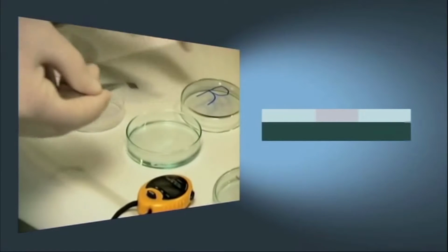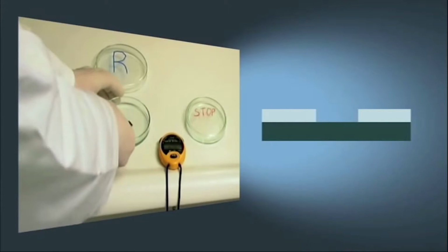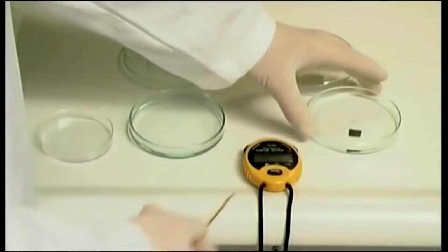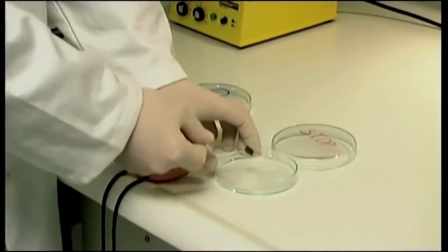Take the wafer out of the microscope. We put it into a solvent to develop it. The solvent is chosen only to dissolve and remove the parts of the polymer which were irradiated by the electron beam, and leave the rest of the polymer film intact. After the wafer is cleaned, it is ready to move to the next stage, metal deposition.